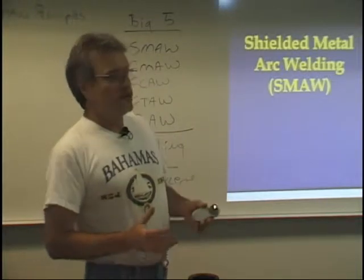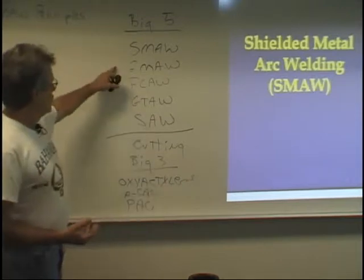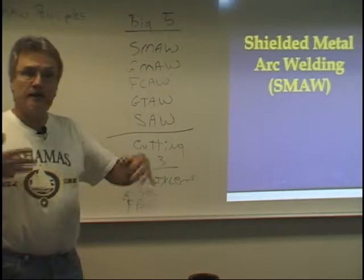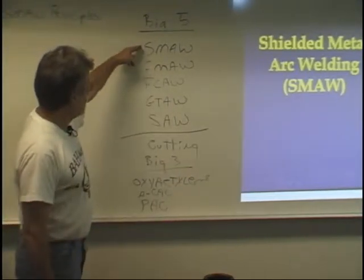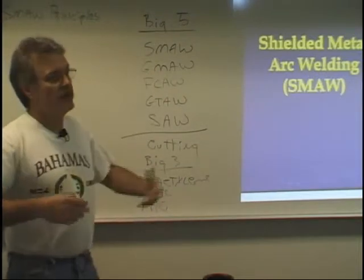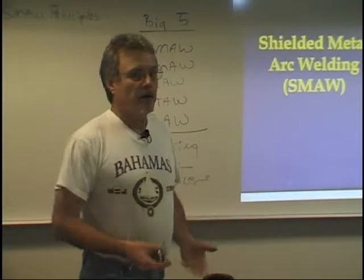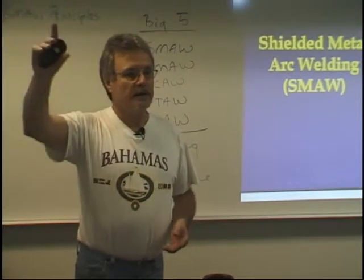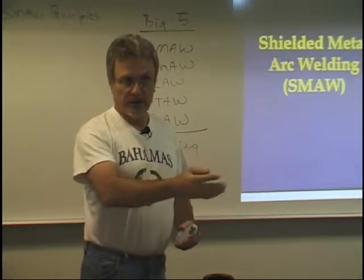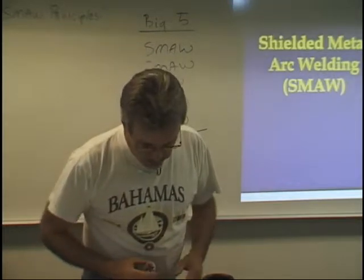I worked for 13 years in the field, 9 years in fabrication shops where we use mostly MIG and dual shield. But when you're out there in the field in power plants, heavy construction, it's usually SMAW and GTAW. So SMAW is for fabrication of heavy weldments in industry, and they also use it for repair. If you go to work in any of these mines out here, you may be called upon to do some repair. The pad that you build in 1755, that's a repair technique. Okay, so that's one of the things that they use.